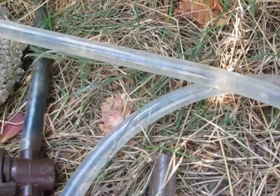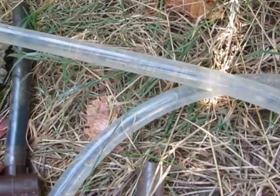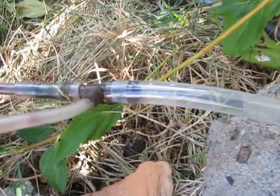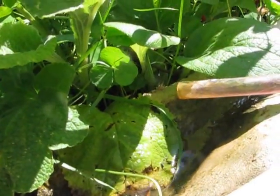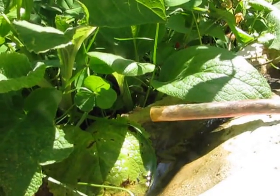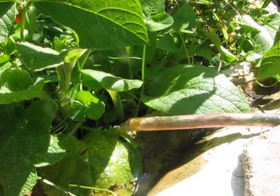You see it's still going — I've just got to do it some more. It's still going a little, but if you look here, it's starting to almost stop now. We should look back up top, and our flow is totally different. Even though the same amount of air — or possibly a little more air — it's going much faster. I haven't changed the air setting, I've just added a constriction.